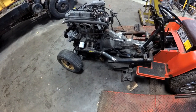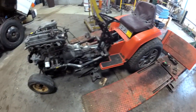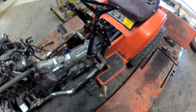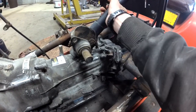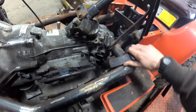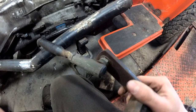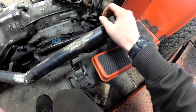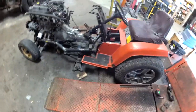It should be pretty simple. I'm going to be pretty much using stock mower steering, which isn't really a good idea for this, but this is actually built pretty well for a mower. We actually have a real steering box on there. I got to fit an arm deal here. I'm probably going to put these tie rod ends here — the mower ones pop off the socket all the time, so I'll probably replace them with heim joints or something a little safer.